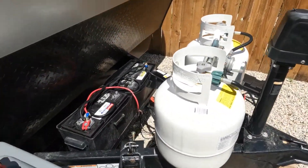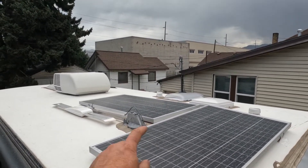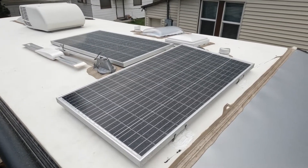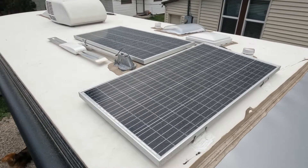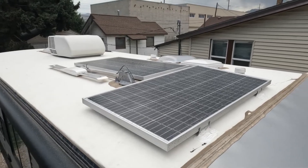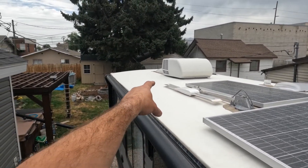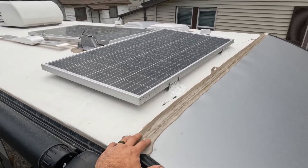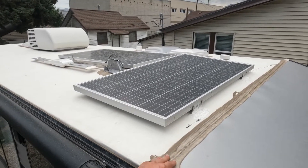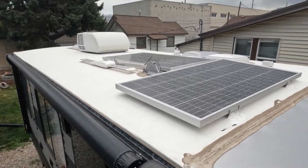Once it's fully charged we should see about 13.7 volts on our solar monitor, so we're going to put the caps on and we're ready to rock and roll. Here's our finished product — we've got our solar panel there, and we're getting 13.7 volts in broad sunlight. It's about to storm so we're probably only getting about 12.5 volts right now with partial sun. We took this out last weekend and were completely off grid for four days — this kept our food in the fridge nice and cool, we had the lights on at night, and there were no issues with having a shortage of power.